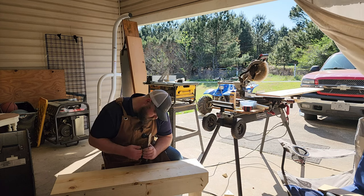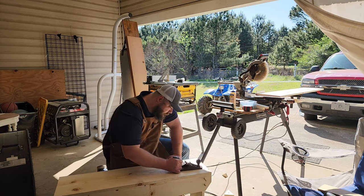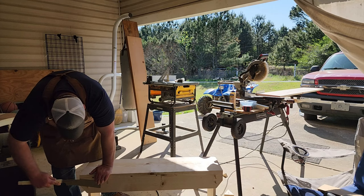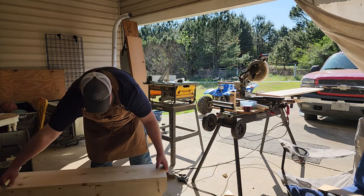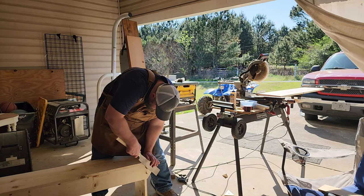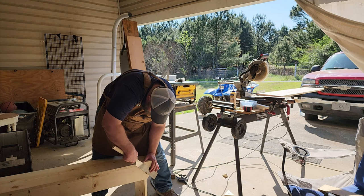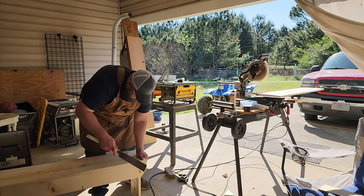It was a real struggle around the knot but away from the knot it was nice and easy. Once I got over it — I was trying to cut off too much too quickly — once I dropped it down a little, see how smooth that goes? It's pulling off real thin shavings of wood. A plane is something you want to keep the bottom smooth and keep your blade super sharp so you get great results. Here at regular speed, this is me using that Japanese flush cut saw — I'm just cutting right through because it's a cross cut blade. You hold your hand down on one side to keep it flat, then curve it away to make sure you're not cutting into the surface — you're just cutting your wooden pegs off. It's a very aggressive cut but gives you a great smooth finish with minimal tear out.